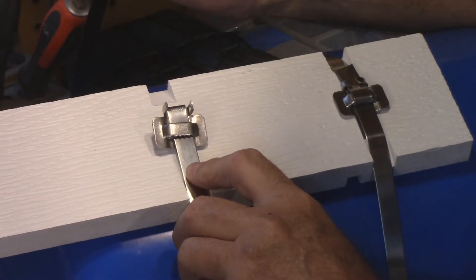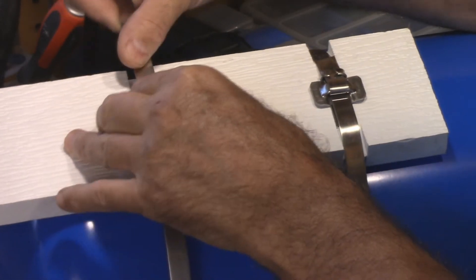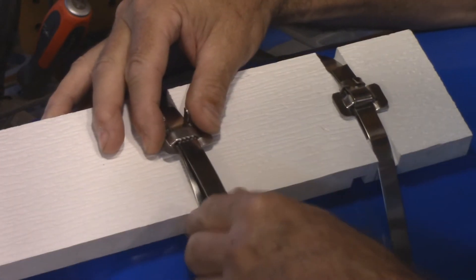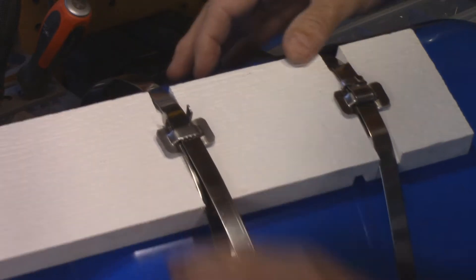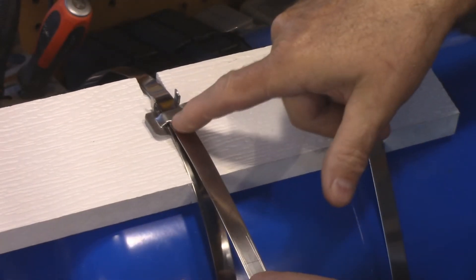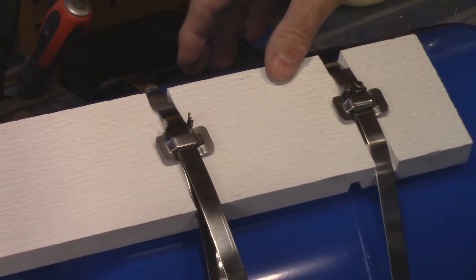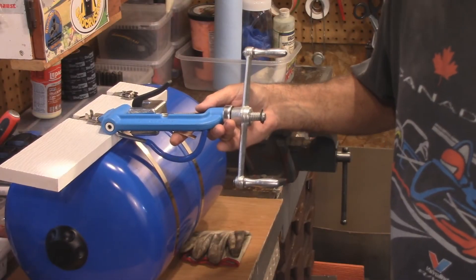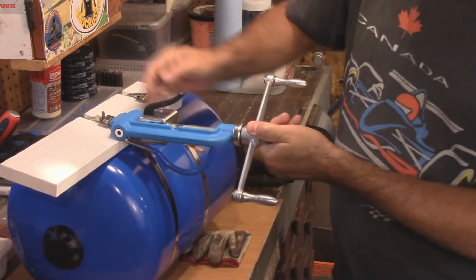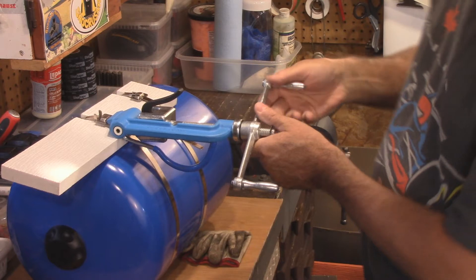Okay, we're all ready to go. You've got your buckle on, you slide this right over the top with a piece hanging out — it's on there. All I have to do is put the tool on. Remember, the ears go on the far side of where you're pulling. I'll show you how the tool goes on — push the stem as far forward as you can to take up all the slack, because as you tighten it up it's going to pull this way.